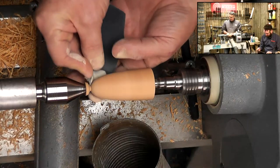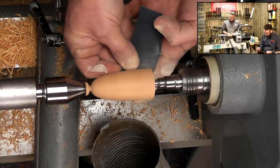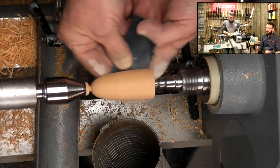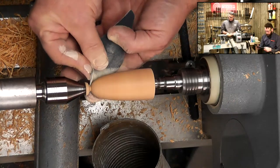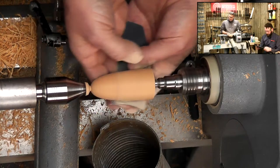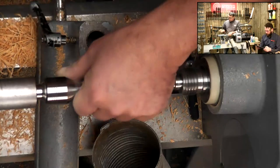I would put a sanding sealer on these. These are going to be sanded, have some flats sanded in. If you use a sanding sealer where you can initially and then reintroduce some sanding sealer once you've sanded the first flat, that'll give the acrylic lacquer or whatever finish you decide to put on it a nice canvas ready to give you a really, really good finish.